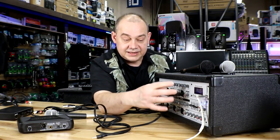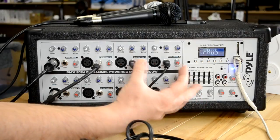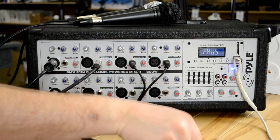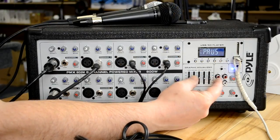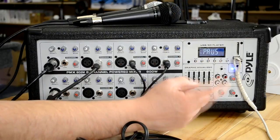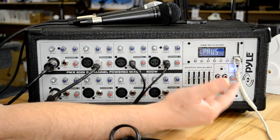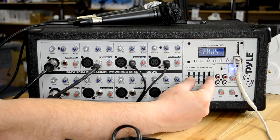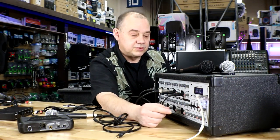The added advantage is that the blue knobs are bass and treble control for that particular channel, and that applies to all eight channels across the board. Plugging things in here allows you to adjust the sound quality of what's coming in — I can tweak the bass and treble for my laptop individually. Meanwhile, the five-band EQ acts as a complete blanket for everything plugged in, allowing me to adjust highs, mids, and lows for the actual speakers so the overall sound coming out is just the way I want it.